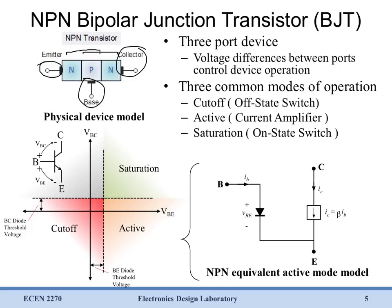We name these terminals the base, the emitter, and the collector, and we draw a symbol for this device as you can see here. Notice that this is an NPN type device and so there's this little arrow pointing out towards the emitter. That's because generally you'll have current flow coming in that direction, following the arrow.